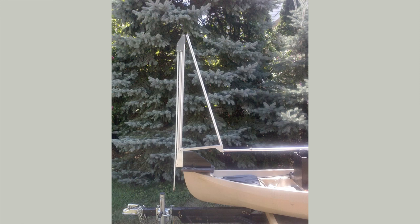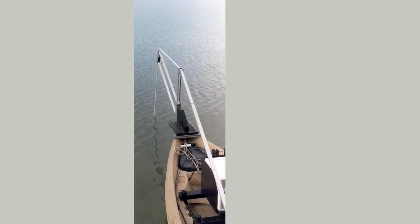If you find the wind or current pushing your boat around while you're moving to a new location, you can drop the pole a foot into the water and let it drag. It will act a little like a drift sock or a keel and straighten the boat out. When I retract the pole, the handle is offset to the side a bit. This has an unexpected benefit — it adds tension to the joints. This allows it to hold its position when it is lifted up but is not fully in the upright position, which saves time when you are relocating.